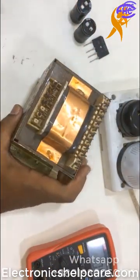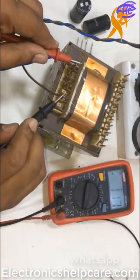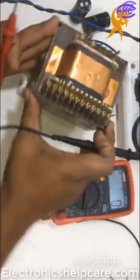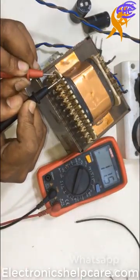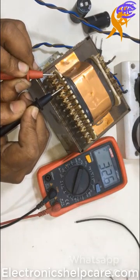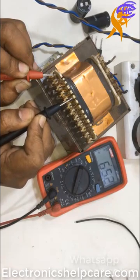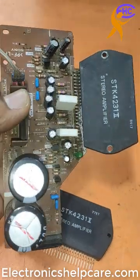Our primary voltage is 220. Look, this is 228 voltage — I am using 228 voltage. And from the secondary I can get: 11 volts here, 32 volts here, 53 volts here, and 65 volts here.